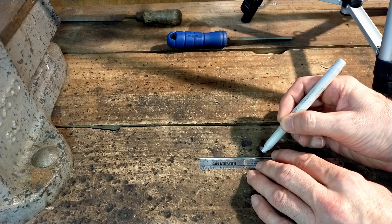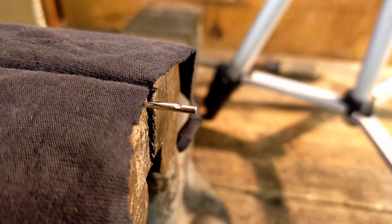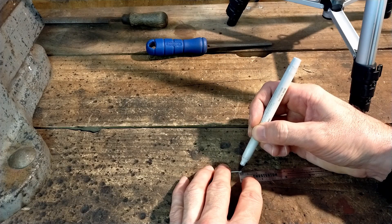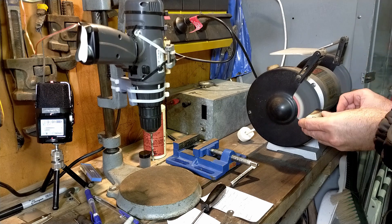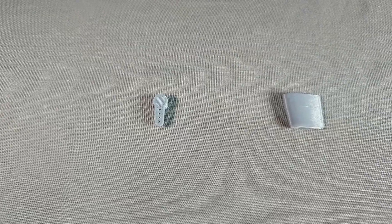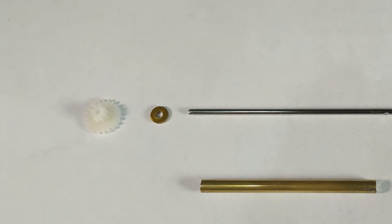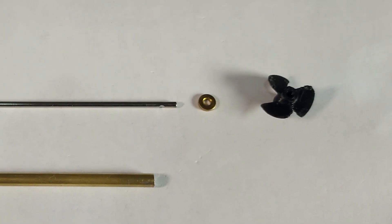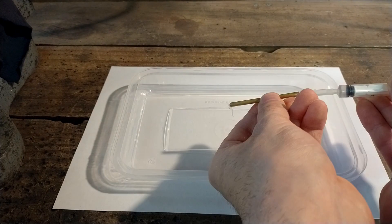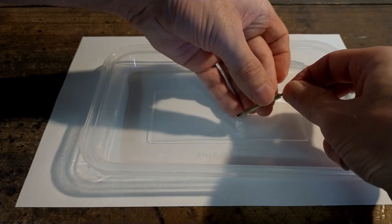Now I start making the inner shafts. I cut them both with the rotary tool and file off the burrs. I file a small groove into the prop shaft — this groove will be used for the prop grub screw. I then measure three millimeters on both ends of the rudder shaft, then use a special tool I made to grind off two flat surfaces on each end of the shaft on the same angle. This is done to lock the rudder shaft steering arm and the rudder in place. Finally I fill both the prop tube and the rudder tube with food grade silicone grease — a nice thin grease that doesn't cause too much friction for the prop shaft.